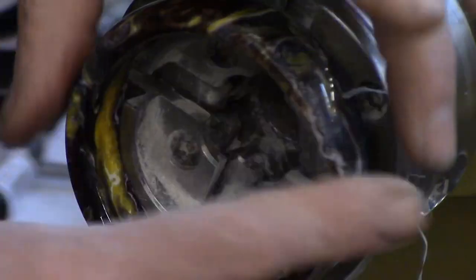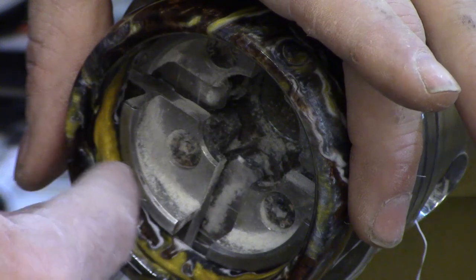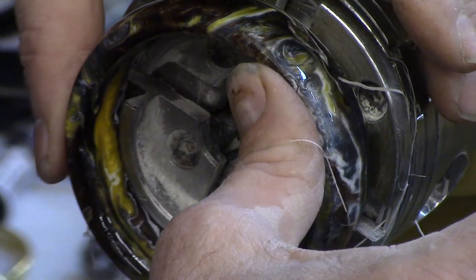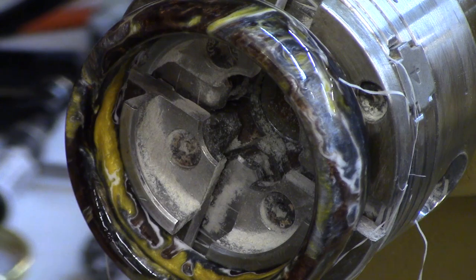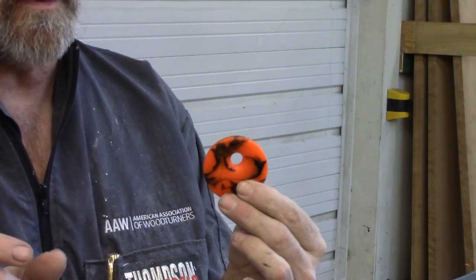If you clamp it so it's centered, now you put your pendant on the center, right? You turn your pendant round. Then if you loosen up your chuck and offset it a little bit, push it over to one side, now you can turn it and you're going to have an offset pendant. So it'll do that whole offset of your circle. That's how I used to do them. It's kind of a cheesy way to do it.